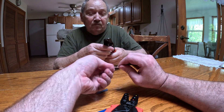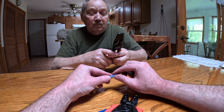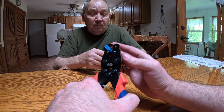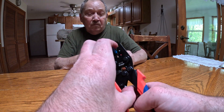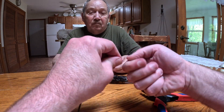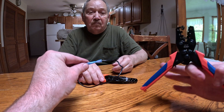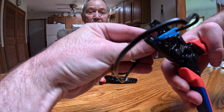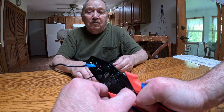I always give the wire a little twist first, because it seems to help. We'll put it in there, and I'm going to crimp this — you can hear it ratcheting. Crimp it down, boom, then release it right there with your thumb. Now we'll put the other end in — blue connector again, very simple. Give it a few pushes; you'll hear the clicking because it is ratcheting. Then you click and release.